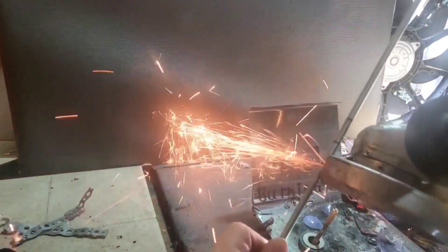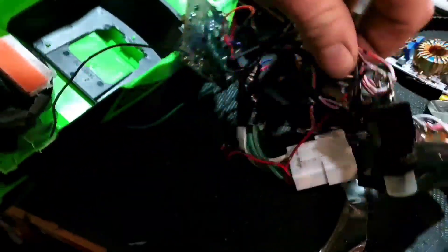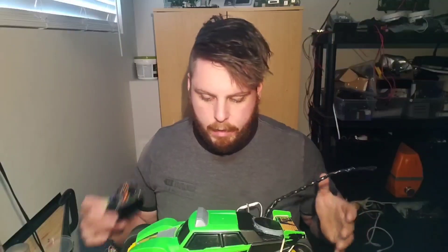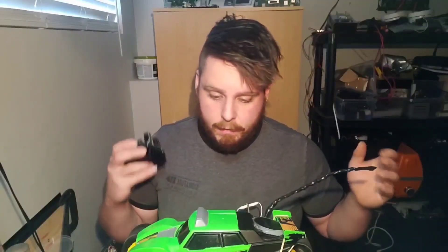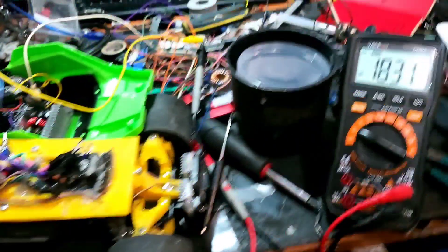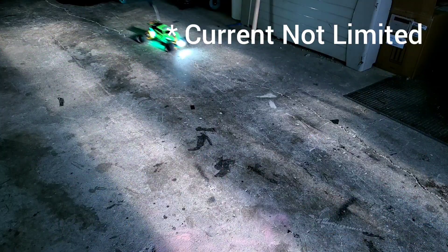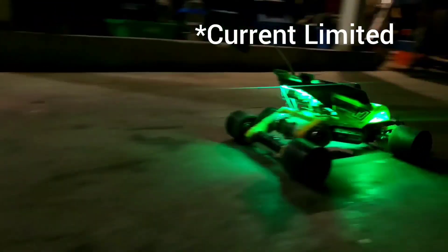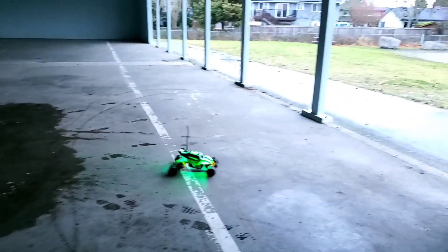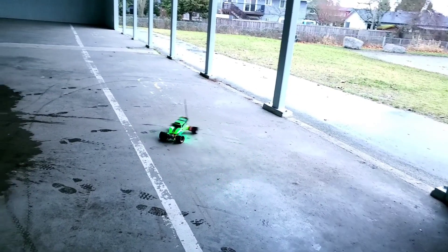After fabricating new parts and making repairs, I needed to find a way to limit the torque applied during acceleration. One of the circuits I used was a voltage converter with a built-in current regulator. These allow me to set the amount of voltage and current output to the motor control circuit so I can optimize for different conditions. By limiting the current I can slow down the rate at which the motor accelerates to top speed, and by controlling the voltage I determine the maximum speed the motor will spin at — letting me vary both torque and top speed.